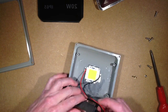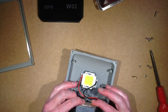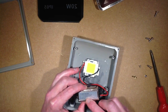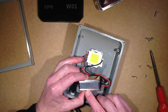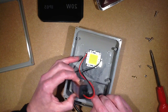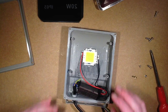Here's the LED driver. Model L0010, 10, 110, 1-watt. Input 100–240 volts, 50–60 Hz. Output 28–39 volts — 28–39 volts because there are 10 chips in series and they're roughly about 3 volts each. At 0.3 amps, 300 milliamps. Has this been labelled wrong? Is this a 10-watt ballast in a 20-watt fixture? Let's test this.